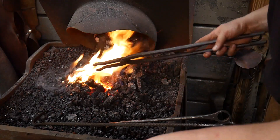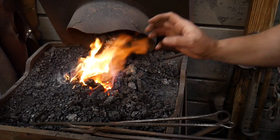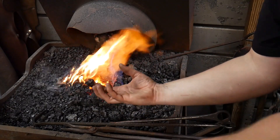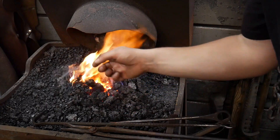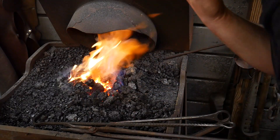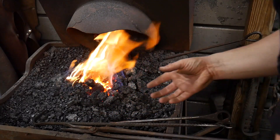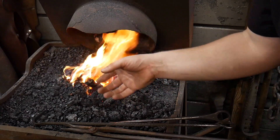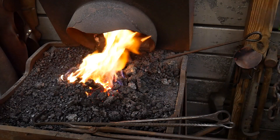We'll let the body of the wrought iron end up tempering the faces. This is a little trickier than normal because it's very time sensitive. You've got to get the face of the hammer into the quench and get it really cool first, then flip it, quench off the peen section as fast as you can, and then put a little stone on them and check them very quickly to make sure they haven't run past temper. This is a very speedy process — you definitely don't want to dilly-dally around while doing it.